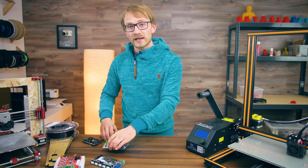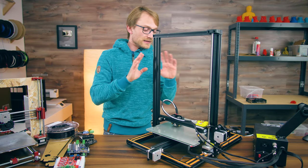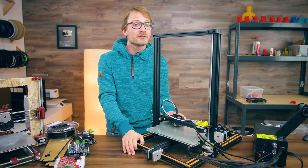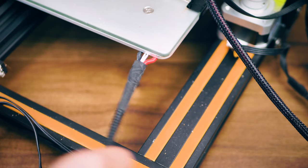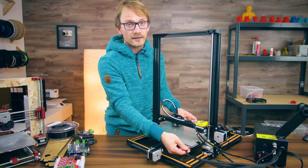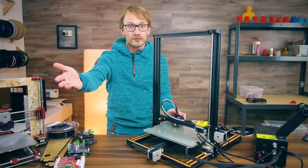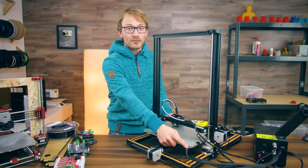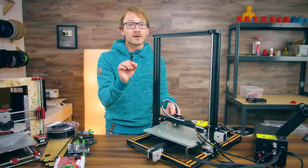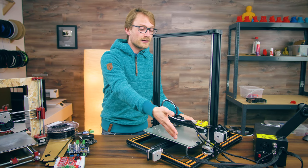The other actually quite dangerous thing I see way too often is heater wires without strain relief — this is a ticking time bomb, basically. It will be fine for maybe the first year or so, but what will happen over time is as these wires get bent back and forth over and over — and you can already see it on these, a 3D printer tends to have very repetitive motion — the individual strands of wire in here start weakening and eventually break. If you own an iPhone charging cord, you know exactly what I'm talking about. At that spot where the strands start breaking, you're reducing the gauge of the wire to only the few strands that are left, but the current is still the same, so that spot starts heating up and faster than you know it, you've got an electrical fire right there.